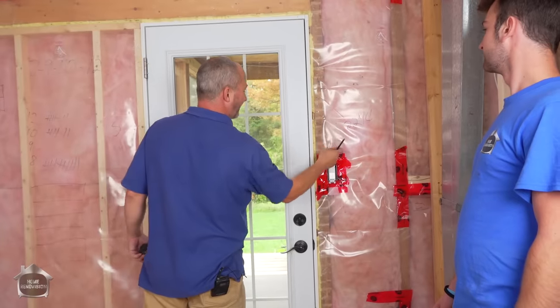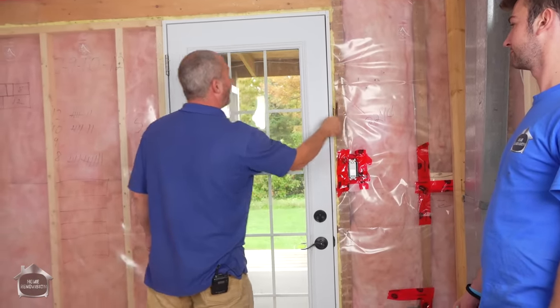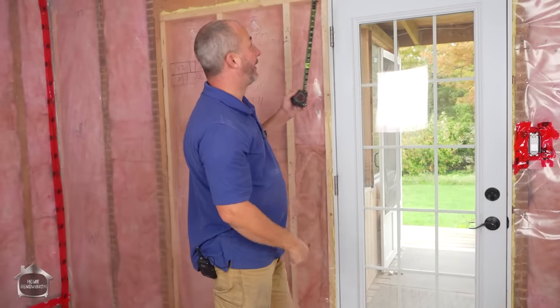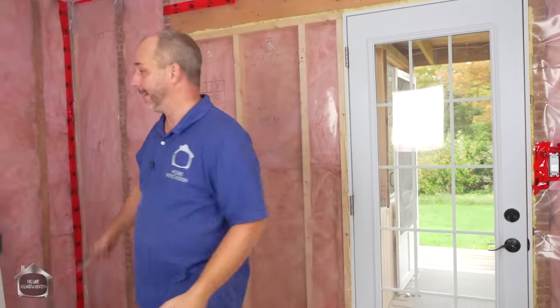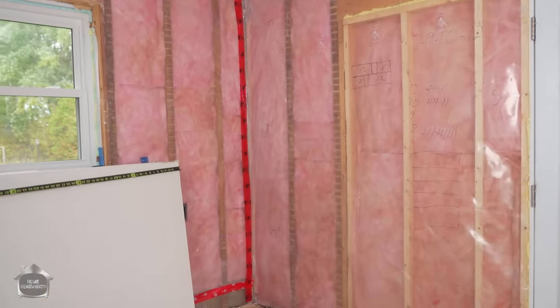And we'll measure right to left in these cases where we want the drywall to end. We'll put the number here so that we can translate that information. We're going to go tight to the ceiling from a factory edge, so we can also measure from the ceiling down to the header. Get me those 2 points as well. You do all of that. I'm going to start translating this information from the full sheet, and I'll cut the board.